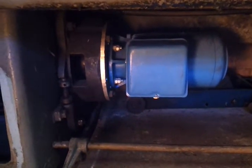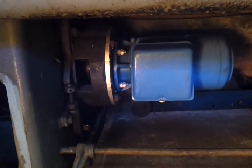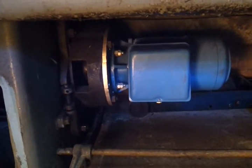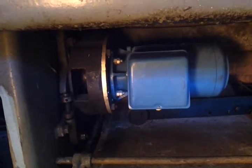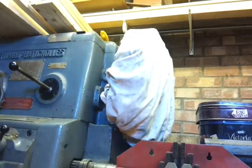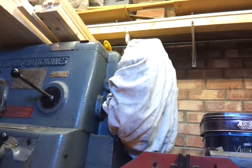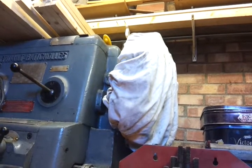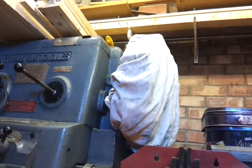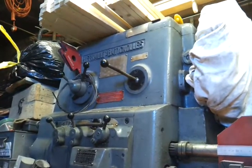I got this a few years ago. I fitted it and made that aluminium faceplate — kind of a flange adapter thing — so that it would fit. But it wasn't a groundbreaking success. With the chuck, which I've currently got wrapped up so it doesn't rust, it's about 5 inches depth and 18 inches wide. That's just an absolutely huge amount of inertia to overcome, even when it's geared to turn as slowly as possible.